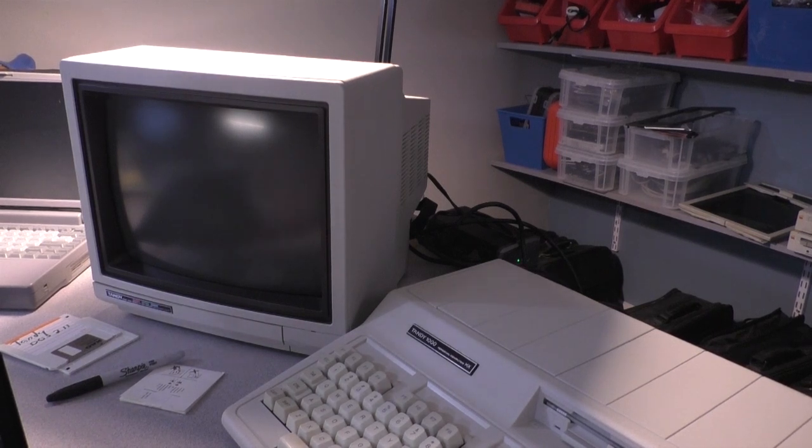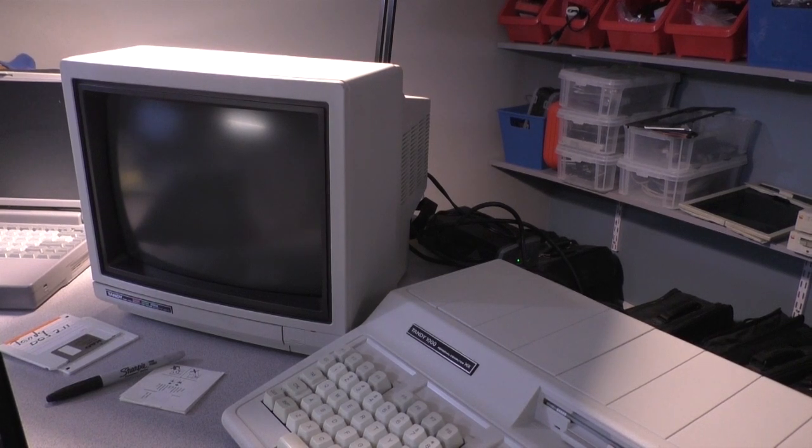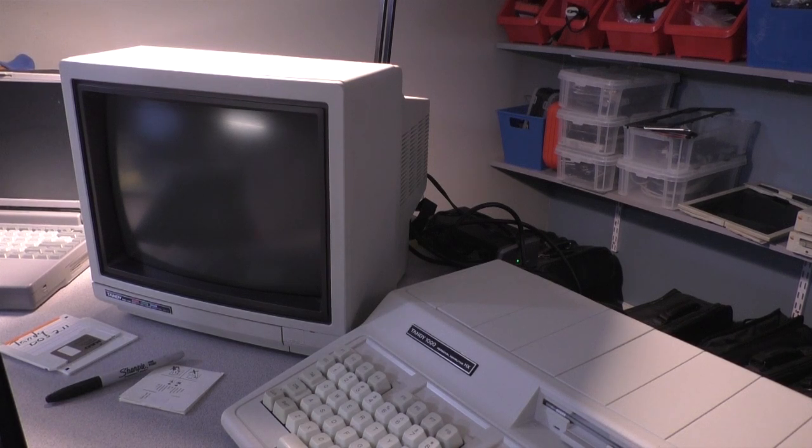Just a little recap, it had one problem, and that was a broken solder joint somewhere in the VGA connector. So simply reflowing and adding solder to each pin solved the problem. And here it is, running. But I don't think we're out of the woods just yet. But before we get into that, I'm going to do a quick recap.